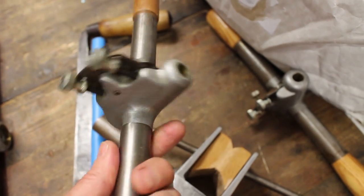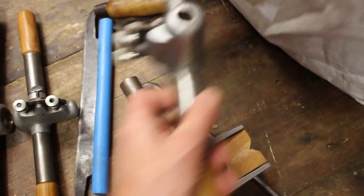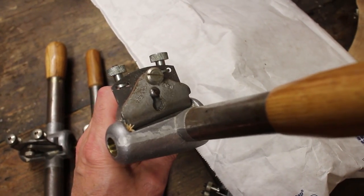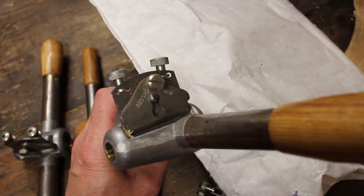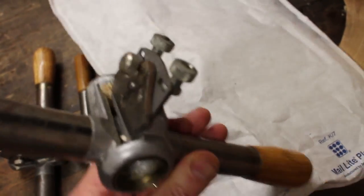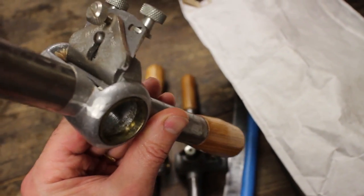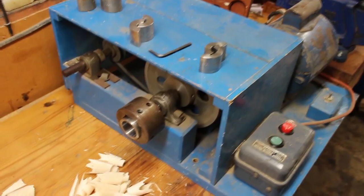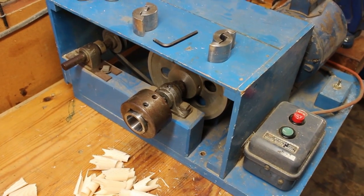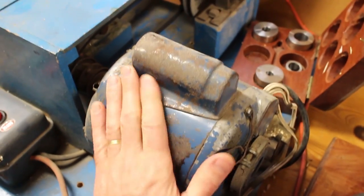These are quite effective — they take you right down to tiny diameters, really down to three-eighths of an inch. They're essentially just a spokeshave blade; that one is a record spokeshave blade put into a little aluminium cast body. I will at some point put a video up on making these. I have now got my furnace back into operation. The actual sort-turning head I use is a homemade device — it would have to be, wouldn't it — with a rather crunky old quarter-horsepower motor.